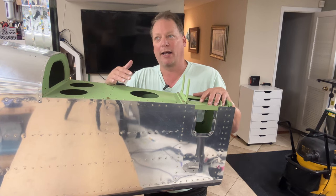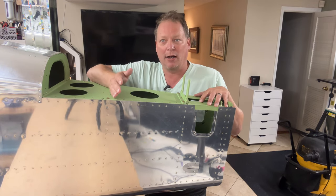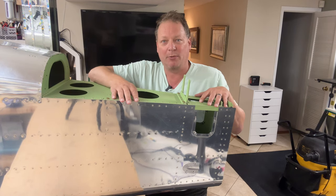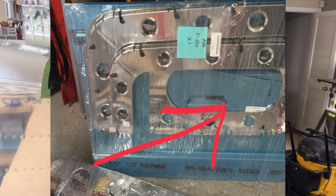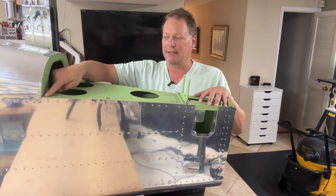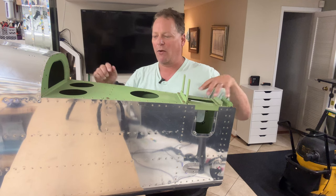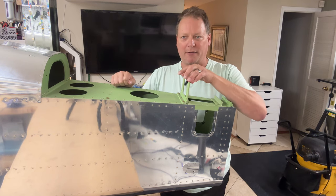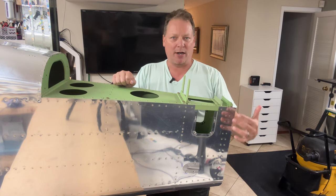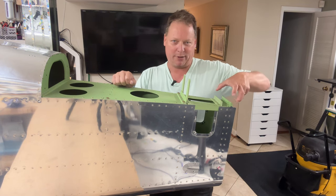I went back through a lot of my prior videos and my unboxing especially, and those bulkheads had no blue plastic on them, so one would assume those were laser-cut parts. However, I did find an image showing my top deck here was in blue plastic, which should mean it was not laser-cut. So what I'm going to try and do, if possible, is preserve this — keep all of these rivets into this bar the same. I know I'll have to drill out these to get these ribs out, and deal with the horizontal attachment bars. So the plan is to drill out this pair all the way around and remove number 12.